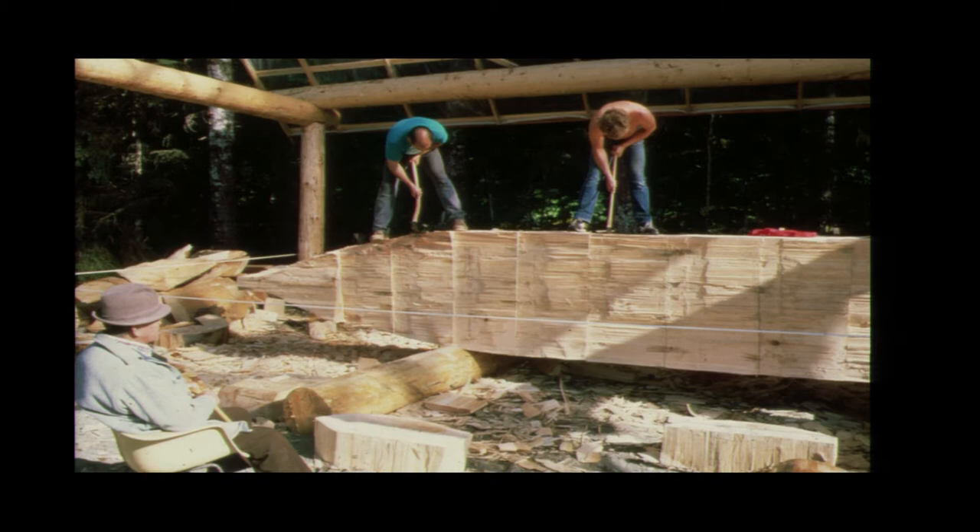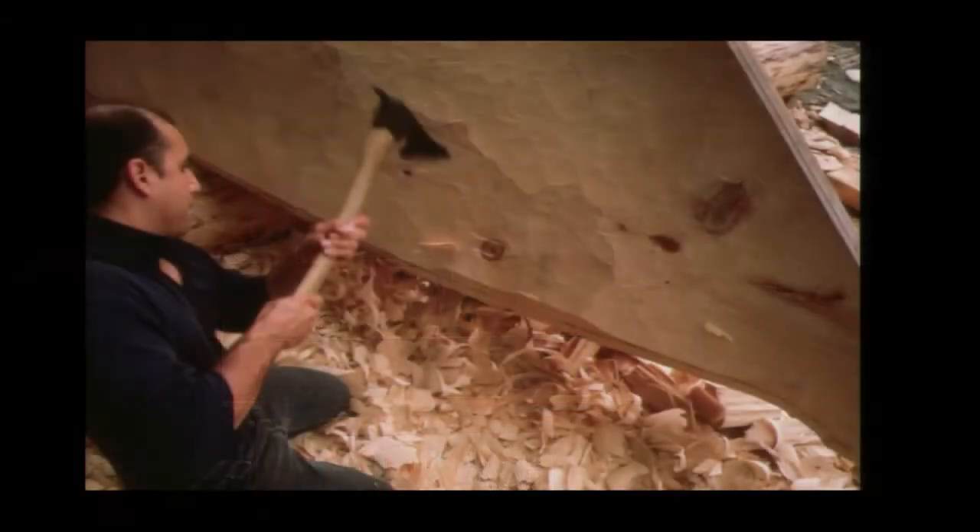We had our inspector here — George. He was always on site. Every morning at 7 a.m., for some reason I had to go get devil's club bark and then one bucket of salt water. He'd act like he was washing us down for the day, and then we'd have to put a little water in the spruce shavings in each corner every day. Here I am working the adze, trying to get that taper down, working the outside. We ended up with a lot of chips, and you save your chips because you're going to steam the canoe when you're done — they're the fuel for it.